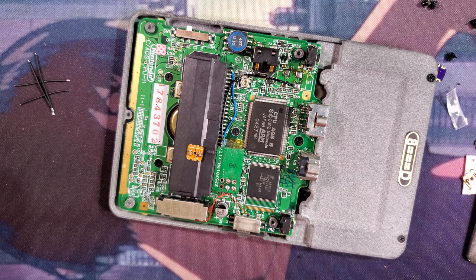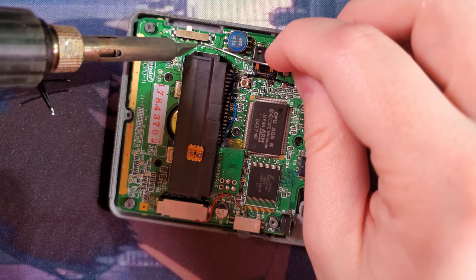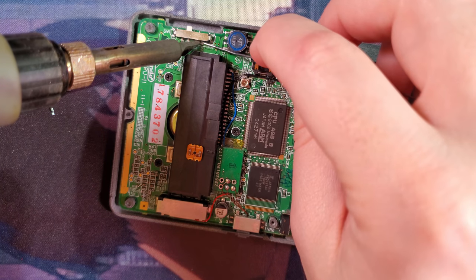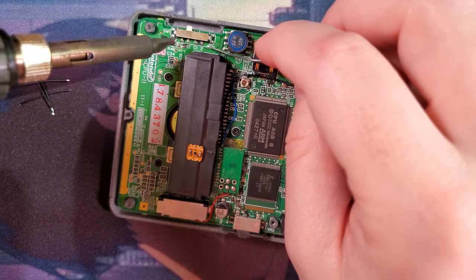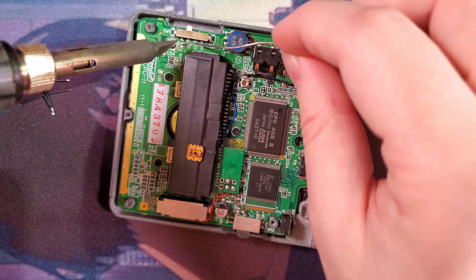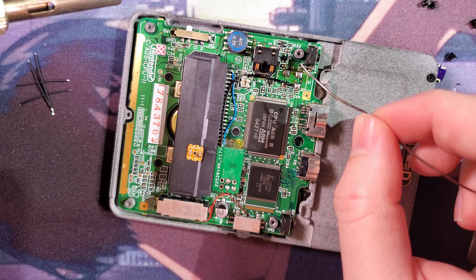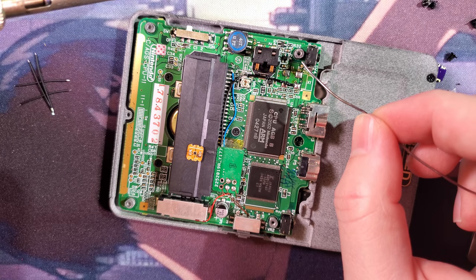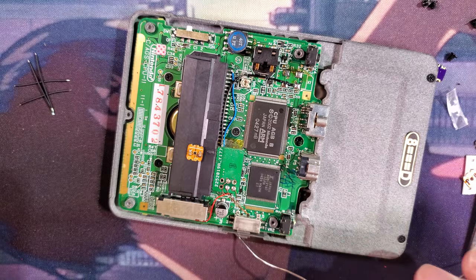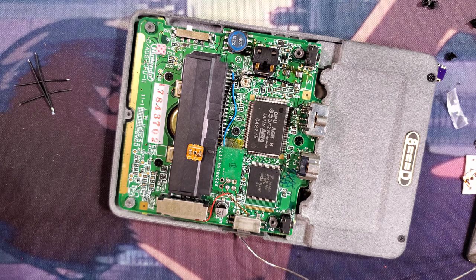And so we need ground and battery positive. We will use pin 2 on the power switch as battery positive. Also solder to the common. Already got that tinned. And then we need ground. Which ground shall we use? Could just use that last. No. We can't use that last pin. We gotta have a solid connection to ground.